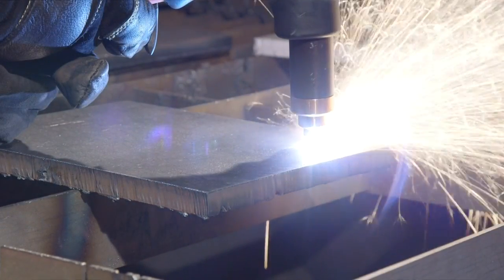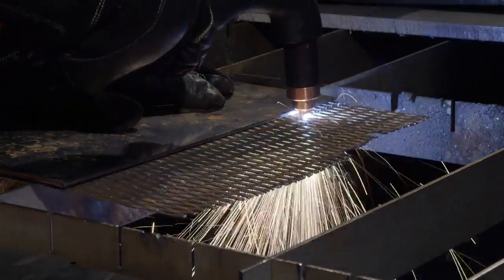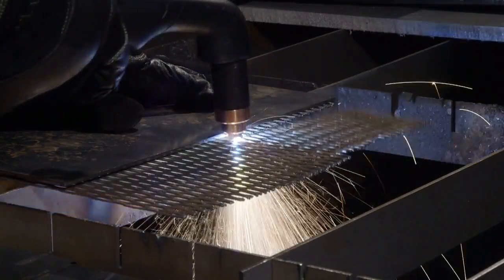It is recommended that the rolling technique be used on thick metal to minimize damage to the consumables caused by the blowback of molten metal. To cut expanded metal or metal with a lot of holes or gaps, simply follow the same procedure as outlined for plate cutting.